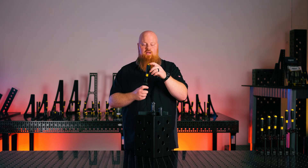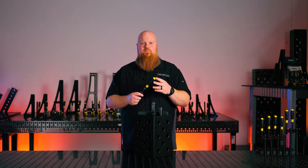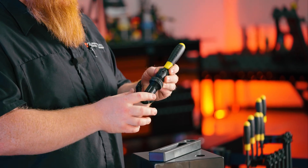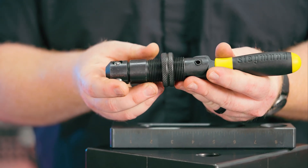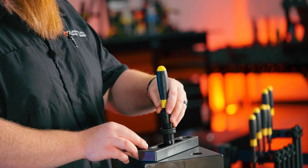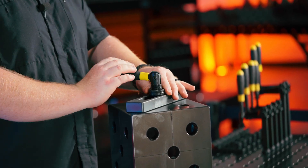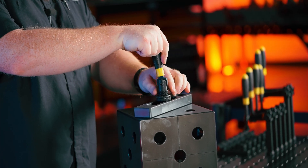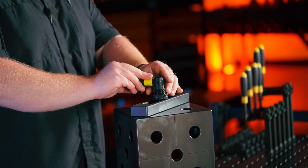Today we're focusing mainly on the short fast clamping bolt with the quick release handle. The biggest benefit is right in its name — it's got the quick release handle. It has a knurled thumb screw to adjust the tension you're applying on the accessory or the metal you're bolting to the table. You can loosen the knurled nut to reduce force, so you can really fine-tune how much clamping force you want.